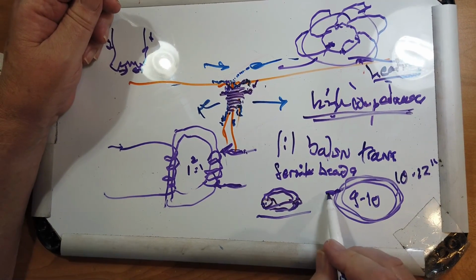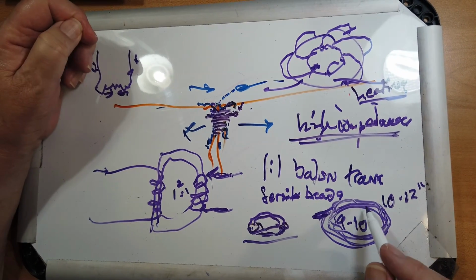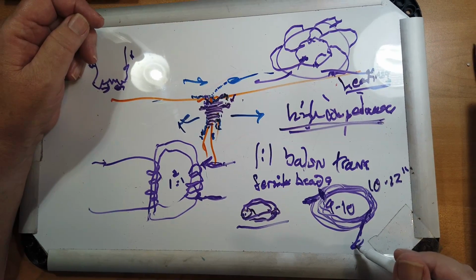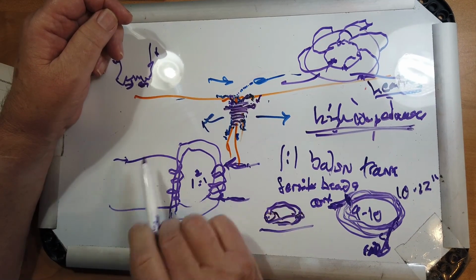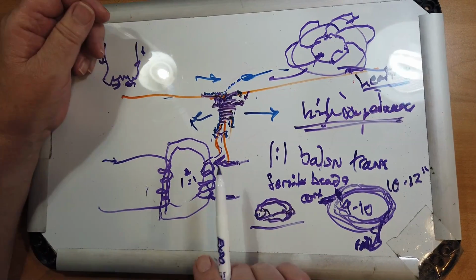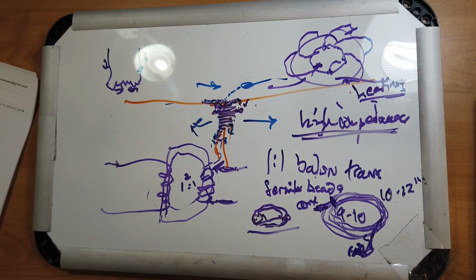What happens here is that the signal that's going down the outside encounters this impedance made up of the outsides of the shields of the coax cable. And because it encounters a high impedance, you don't get so much coming down to the antenna, or to the radio. This goes to the radio. This goes to the antenna. All right, so you've got options like this. The other option, of course, is to just connect the coax straight like that. And if you don't get any RF in the shack, just leave it. But that leaves purists sort of in a terrible nervous state when you do something like that.